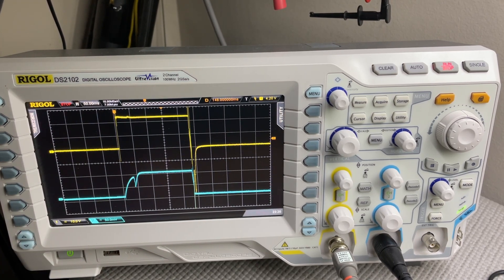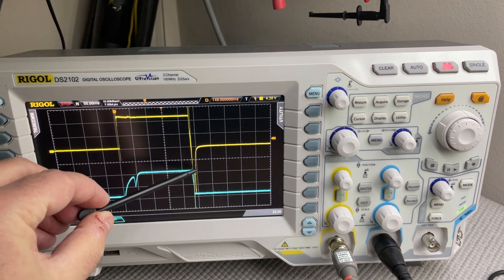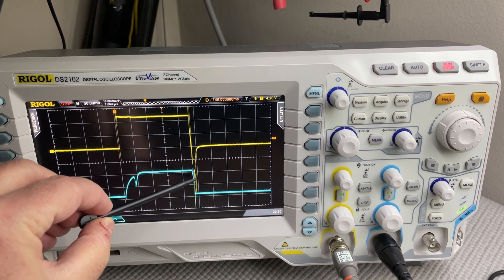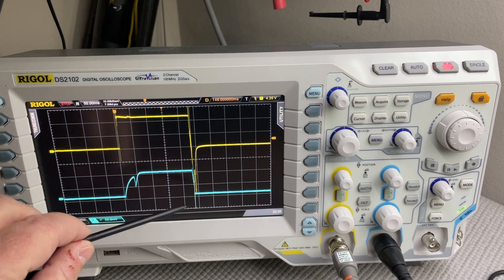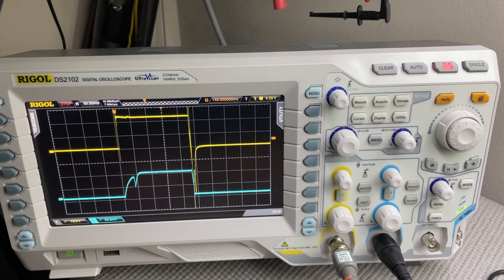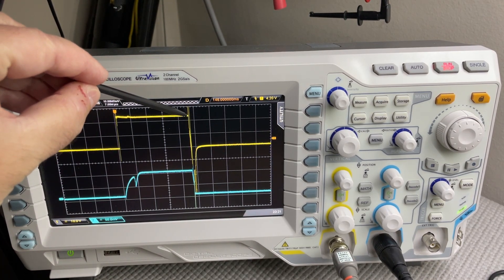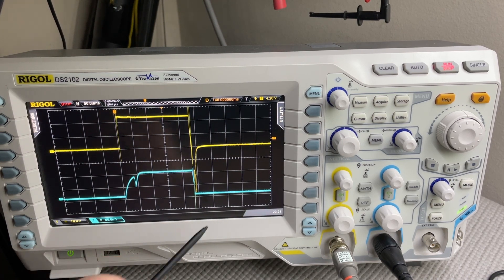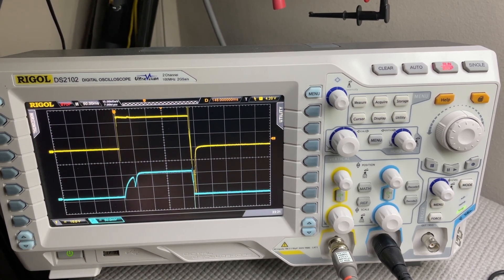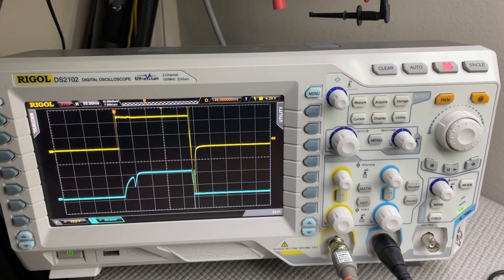The negative voltage spike, once the field starts to collapse, begins to rise back towards zero until the magnetic force has decayed to the point that the spring on the armature can push it back to its initial position. Once the armature starts to move, you get an induced voltage which drives the voltage back negative again, until the armature finishes moving and the magnetic field continues to collapse, taking the voltage back to zero. The closing response time is the time between the opening of the switch to the bottom of this dip; the armature stroke time on de-energization is the time between the top of this dip to the bottom of this dip.